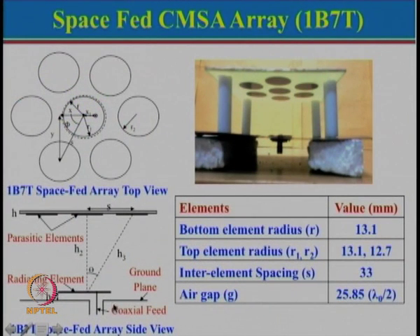We came up with the concept: why feed from the side where the whole thing is also radiating? Why not feed this particular array from down below? We have a ground plane, this feeds through, it radiates, and radiates further upward — with no aperture blockage at all. That was the thought process with which we started working on it. Here is a ground plane, on which we have a microstrip antenna that is fed — only one patch is being fed — and this patch radiates in the broadside direction. We can have a number of elements, rectangular or circular, in any configuration.